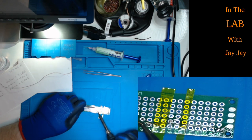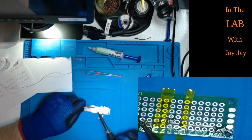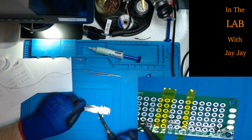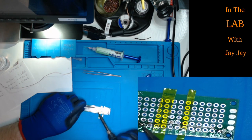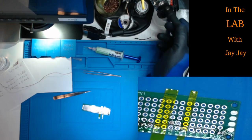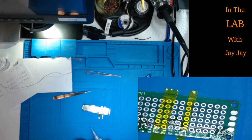By the way, I've got my iron set at 337 degrees Celsius. I've been experimenting with some tip temperatures, and this one seems to be pretty good. It's 37 because 37 is my lucky number. And my lucky number's been working out for me, so. Now we're just going to add some flux and some more solder to this joint.